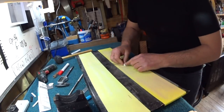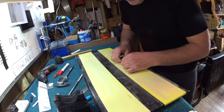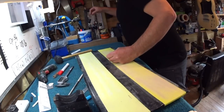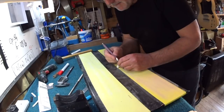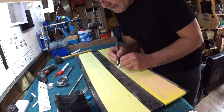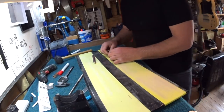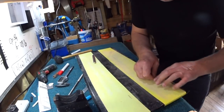So, here we go. And we want to keep a square bottom. So which end am I going to put the push on? This end here. So, let's help ourselves along the way with some marker pencil, so we can see what we're doing. Soft pencil. It's going to help guide us. So bass end, we want to take off 0.6. Yeah. And pushing down on the bass end alone.